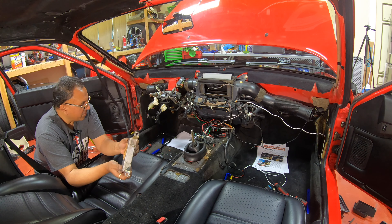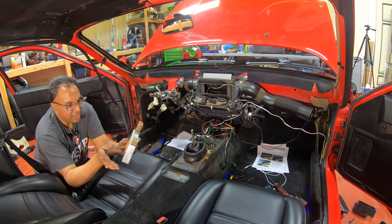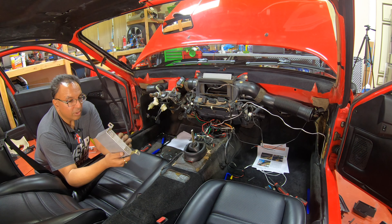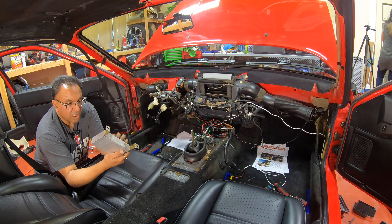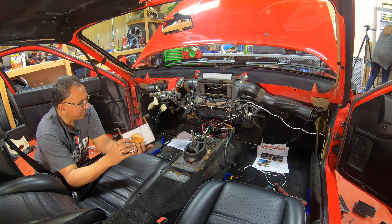Whether it works or not I don't know, but it's got some weird issue — the actual actuator is just triggering randomly, so I'm hoping it is dry joints. When I actually did the soldering a lot of the joints were like falling apart, so probably a good idea.